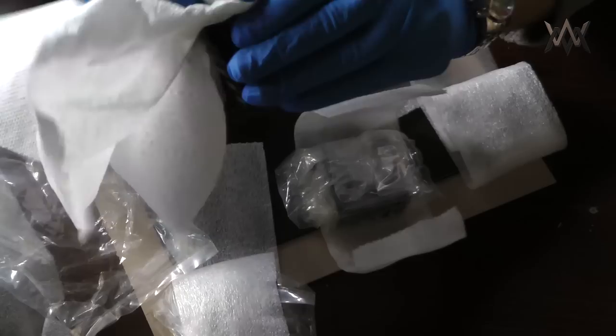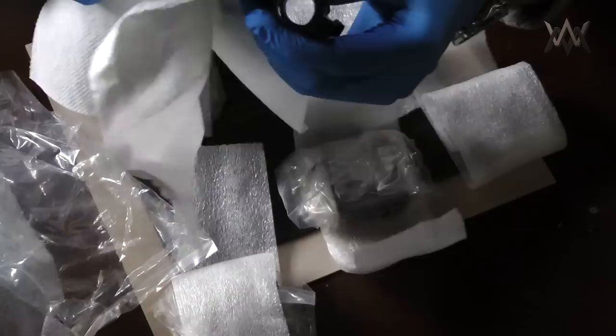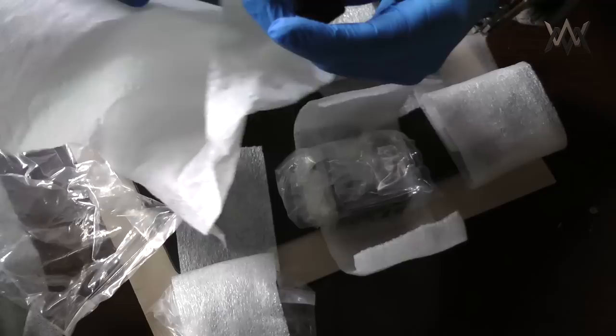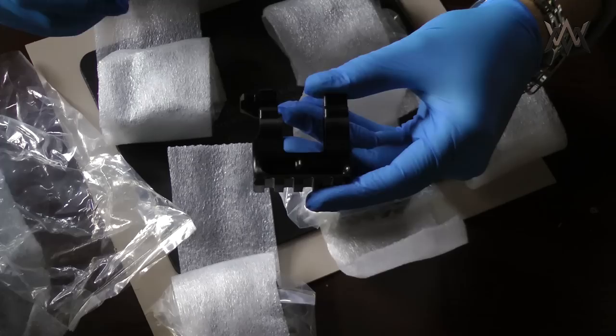Well, I kind of fixed that to where it wouldn't do that, but when subjected to the high heat of nitriding, that area was thin enough to where it bowed out from that or dimpled in. I've since fixed that by making that sling swivel socket post wider.